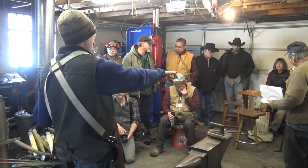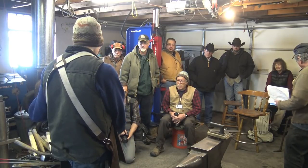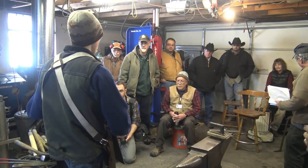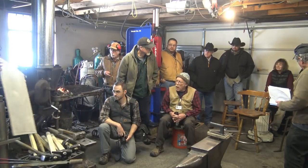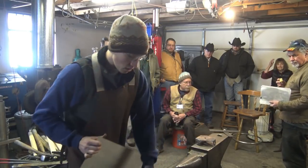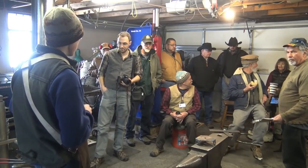There's two plates on it, two triangular plates. The smaller one at the top is a 9-inch equilateral triangle, and the larger one on the bottom is a 12-inch equilateral triangle. I put the dimensions on here for you guys, so if you want to replicate these, you can see where to lay out the holes for everything, and where to pull the lines. I already started and finished the smaller triangle, so you guys can see what we're going for today. And then Garrett and I will finish up the larger triangle, and you can see that forging procedure. You guys have any questions so far?